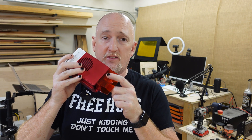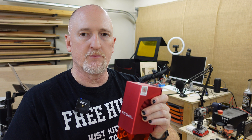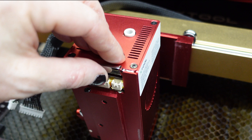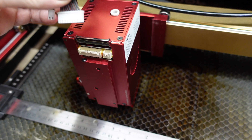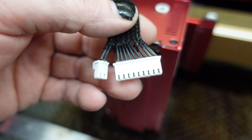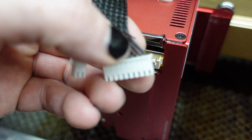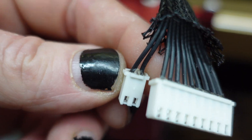Also pay very close attention when your kids are around. Next up is the light shield. I love the fact that they made it magnetic so it just pops on and off now without screwing. But an issue I have with this and the 20 watt is that the laser has to be so close to the material that I often want to take this off so the guard doesn't hit the material or shift the piece. My last complaint is the way this connects — since you're going to have multiple heads for one laser, this needs to be a better, easier on/off connection, because it doesn't take much to pop one of those little connectors out.